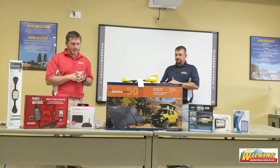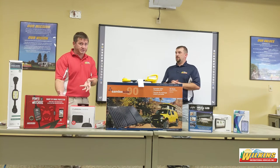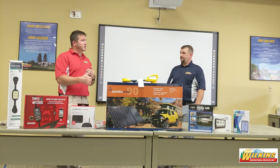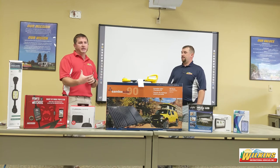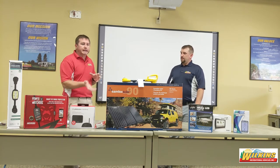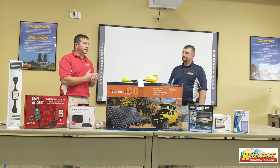When a battery goes completely dead, that doesn't mean it's a junk battery — it means you have to put a full charge back in it. A proper 12-volt wet cell battery takes 24 hours on a battery charger to properly charge up to 100%. As campers, we sometimes don't have that time — we plug it in at the campground and function on the converter at 12 volts. We could be shortening the life of the converter by plugging in a camper with a dead battery. The converter is more of a trickle charger than a proper battery charger at a garage or shop.